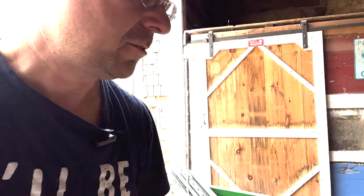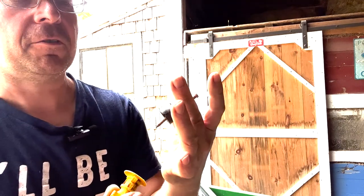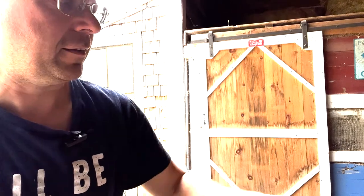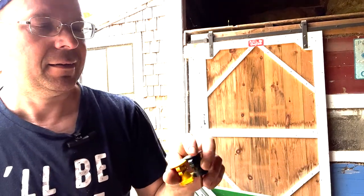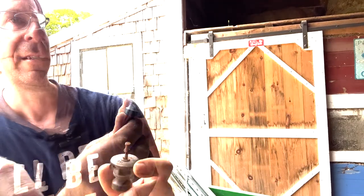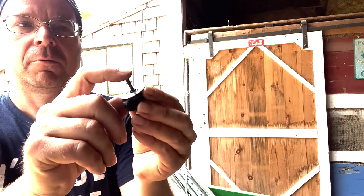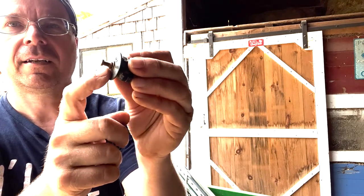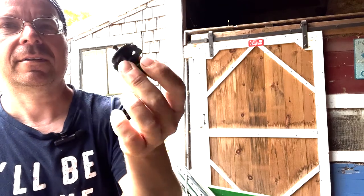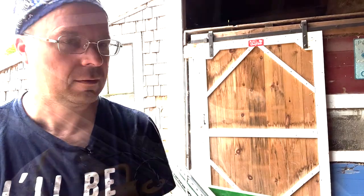And I don't use that too terribly much because these don't really work well for poly rope. These work great for poly wire, and they work great for steel wire, but they don't work for anything else. And they're really cheap, and the nails tend to pull through. When I use them, I use two-story nails. Some people call them foundation nails because they have two heads, so they'll drive these into a board to the first story, and then you hit the second story out so you can still pull it back out. So these are worth buying if you're running anything smaller than poly rope.